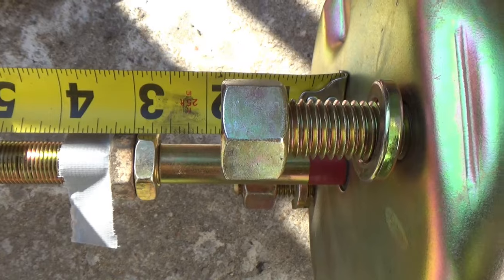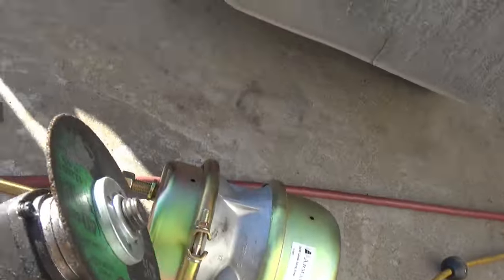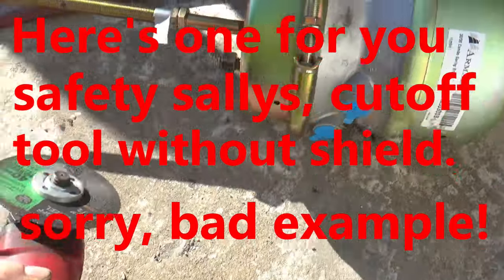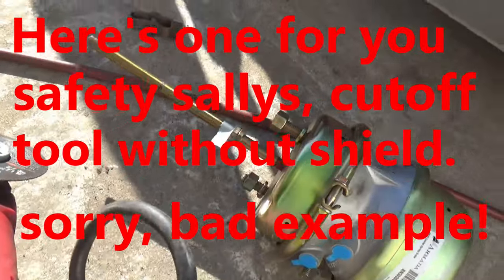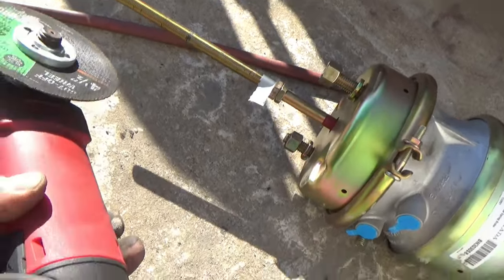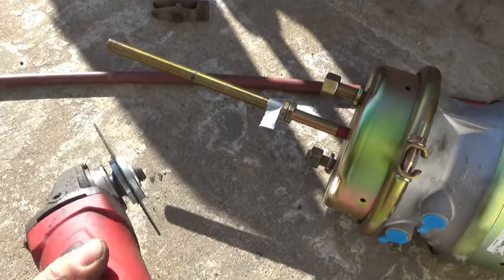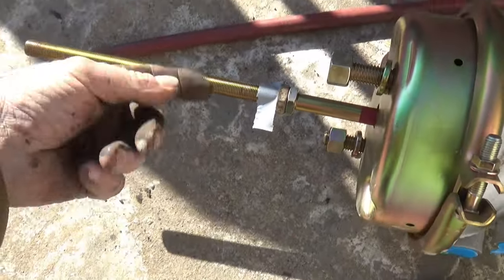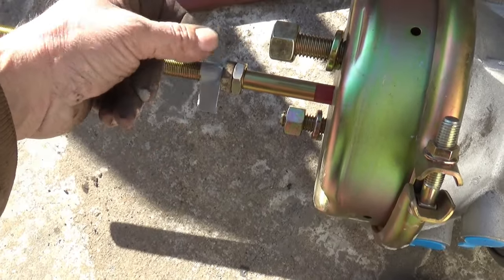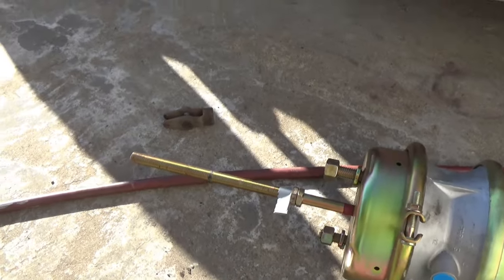I marked my 4 inches with a little piece of tape. Now I'm going to take this cut-off tool with that thin blade and cut this off here. You can cut it with a torch, and you sure don't want to do it with a hacksaw, but if that's all you've got, that's all you've got. This cut-off tool is the easiest way. If you do it with a torch, then you've got to have an angle grinder to smooth off the edges, and run your nuts back off with some oil on them to clean up the burrs off the end of the threads.